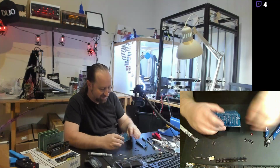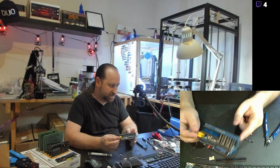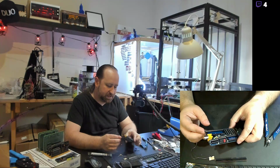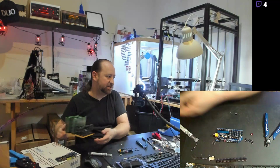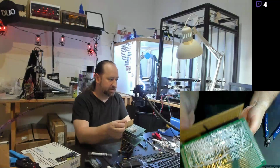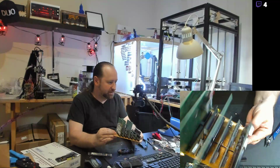So in addition to a 3D printing event, I'm actually putting together a video card for my scratch-built 8-bit computer. This is an 8-bit video card kit, similar to what you would see in a ColecoVision or a Sega SG-1000 or a TI-99 4A computer. In fact, here is the actual computer itself with some of the boards that I've put together. The CPU board was all wired by hand, and it does work. The CPU board I've tested. The actual motherboard is a passive backplane that's wired, and all the boards plug right into it.